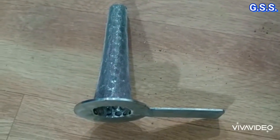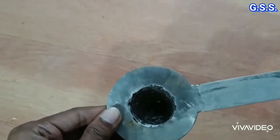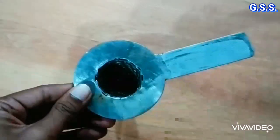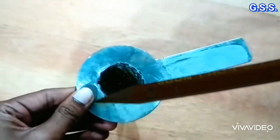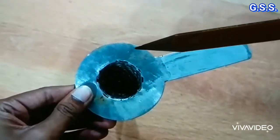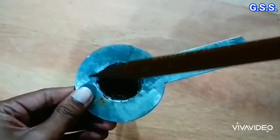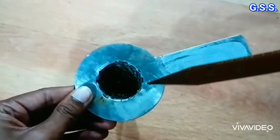This 2-inch conical strainer is correct. Only one small defect is there: the conical ring should have serration on both sides for gasket leak tightness, because this conical ring will be mounted in between the raised face of 2 flanges with gaskets.